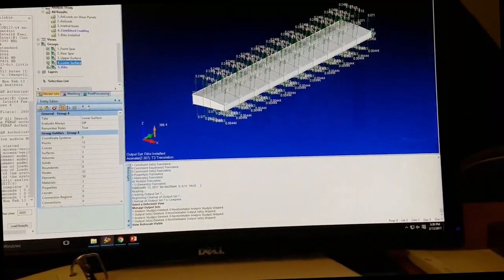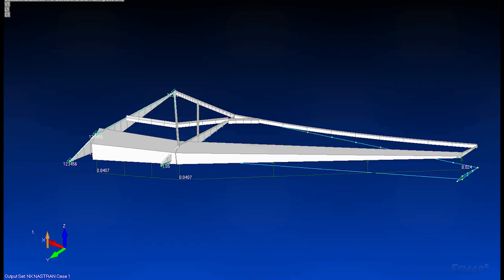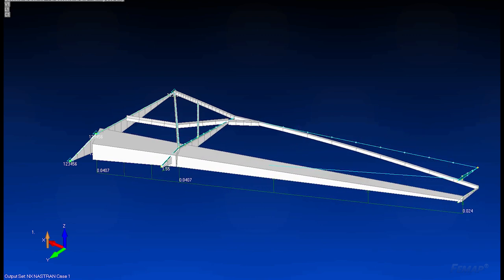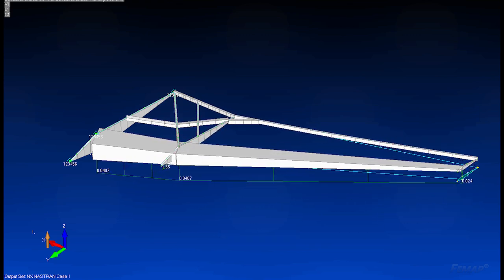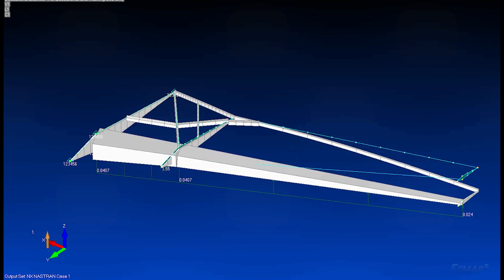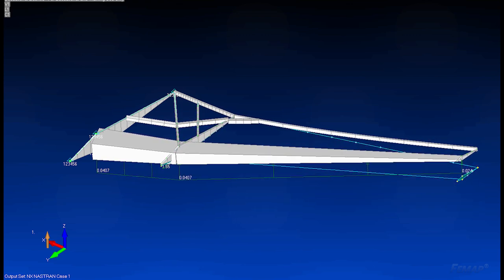I can figure out what the loading would be like on the airframe. From there, I had a little bit of a sketch drawn up, and I actually put it into an NX Nastran file that I came up with for the wing to show if it would be structurally stable at all. And honestly, the initial results were really good. I used kind of a guesstimate for how strong foam core would be, and I put that in, and it didn't show too bad on deflection, but in this model I didn't include any skin. So the next logical step would be to make a prototype.